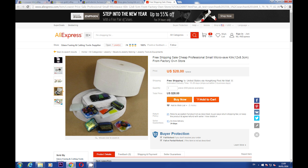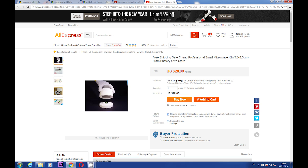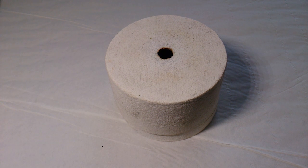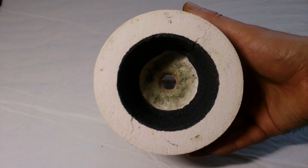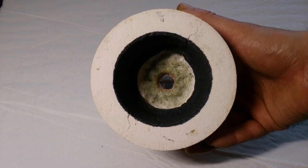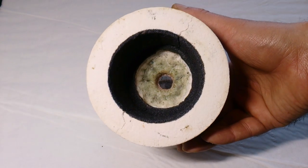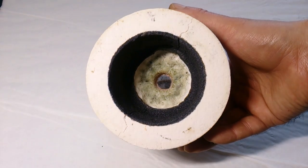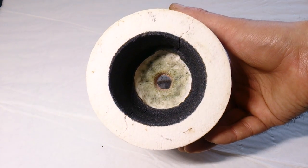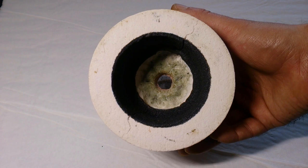Here it is — this is what you have to buy: a microwave glass fusing kit. The only trouble is you still won't be able to melt your gold straight away — actually you can, but you have to use one trick, which I'll show you right now. Here is the microwave glass fusing furnace, something I've already used for about 40-50 melts. Amazingly, it still stays in one piece. You can see some serious cracks and damage on the top, but that was mainly my own fault because I used some funny melting flux. For normal gold melting in this furnace, you don't have to use any flux. It did extremely well, especially considering it wasn't designed for gold melting, and if you use it carefully it may last a long time.